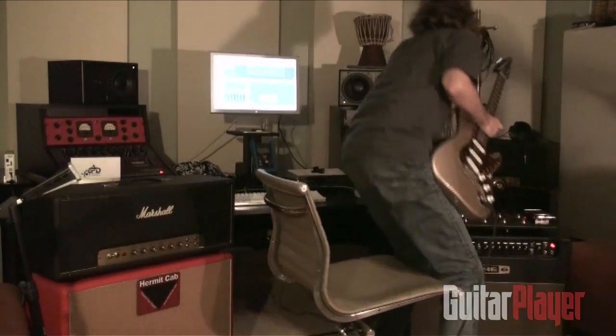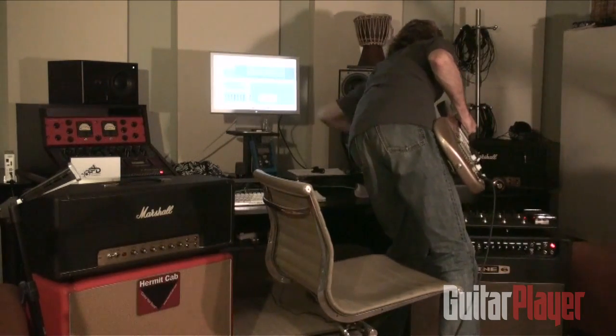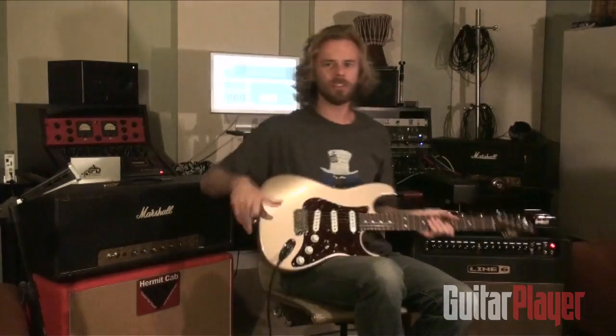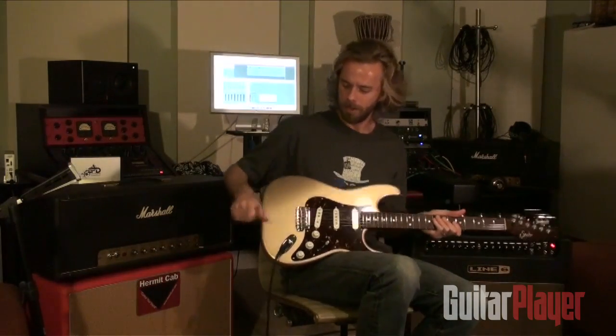Okay, so much less volume. What I'm going to do is turn the mic pre up by 10 dB, and that'll make up for the loss that we have there. And so it's going to sound about the same volume on the video now, but of course it's much, much quieter.